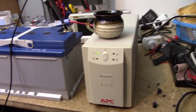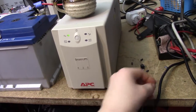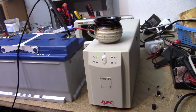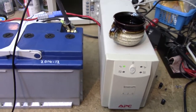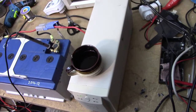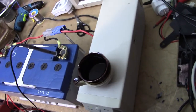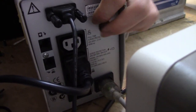This unit has worked fantastically well even though the small caps had probably been degraded for a long time since they were no-name parts. It's made a couple of strange noises and that seems to be all that happens when the caps go bad — it hasn't ever failed me. These can handle about half load continuously with no modifications, which is great. They only have four switching transistors and the heatsinks are those typical APC ones that are just a piece of bent metal. Specification-wise they aren't particularly impressive, with just a couple of outlets on the back.